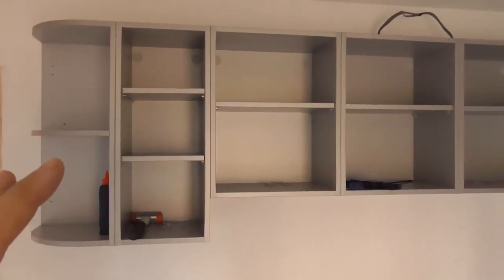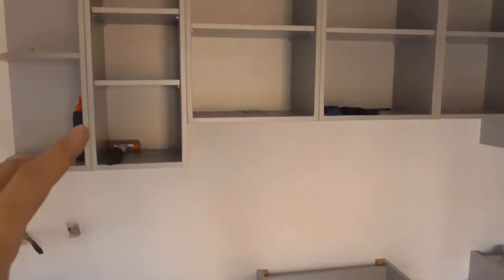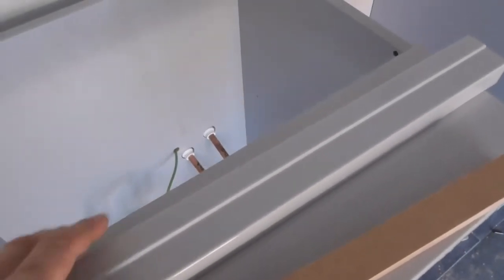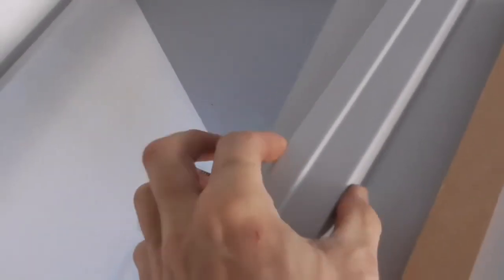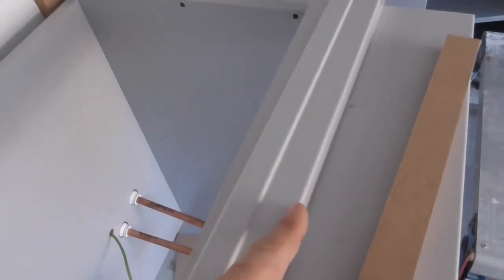So the wall units in this kitchen, they've got a cornice at the top and a lighting pelmet at the bottom. It's all the same stuff. It is basically this. It protrudes past the front of the unit to sit basically flush with the face of the doors. So a little tip here for when it comes to setting and marking it: the overall width of this is 50 mil, and the doors, with the tiny gap, are only 18 mil. They will stick out 20 mil in front of the carcass.